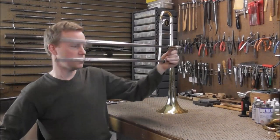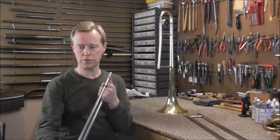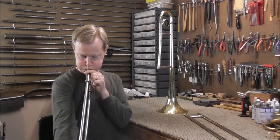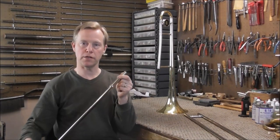If you do soldering on any of the tubing on any instrument, it is a good idea to check for leaks when you're done. Because if there is a leak, the performance of the instrument will go down. So I'm going to cover up the end with my finger and blow on this. No leaks — so the job is done. I hope this video has been helpful. Please subscribe for more band instrument repair videos.